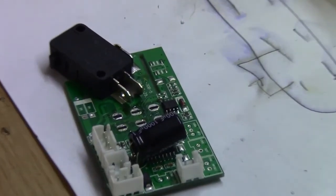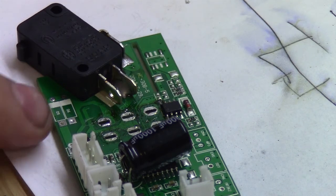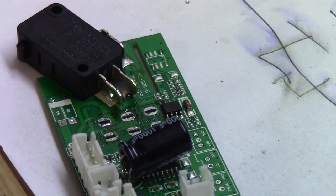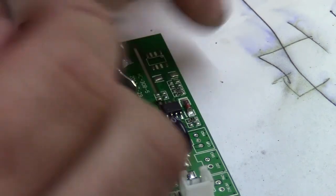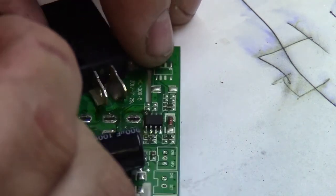Okay, now that also means, remember, if you're cutting a track, don't just make one cut across and then if you think it's good, it's good. Rather, take out an actual segment of track so that the current will have a hard time jumping over it.